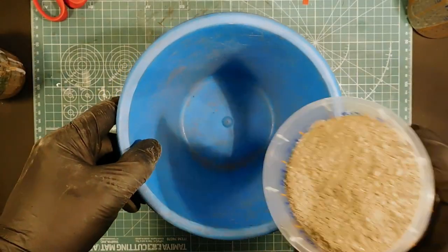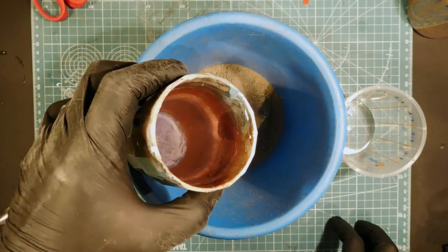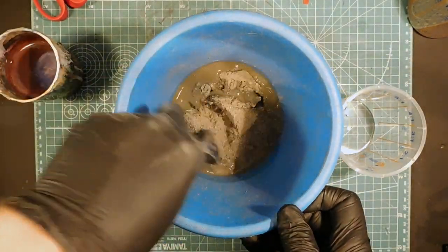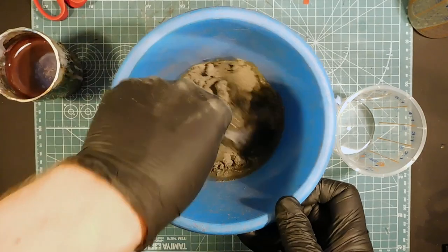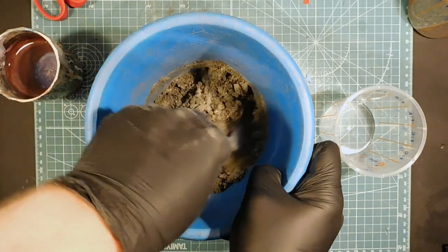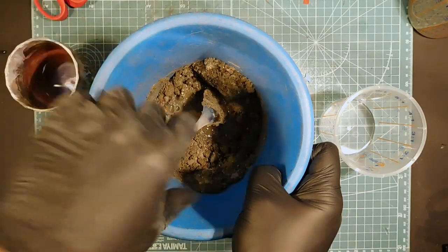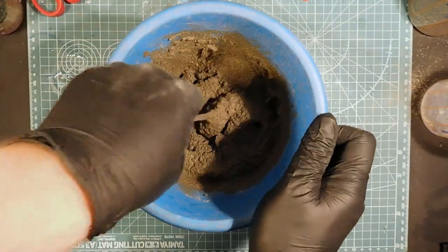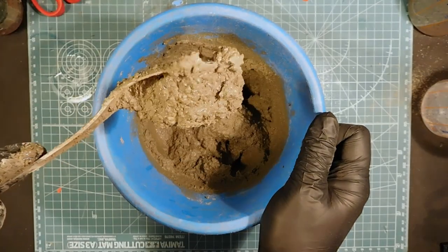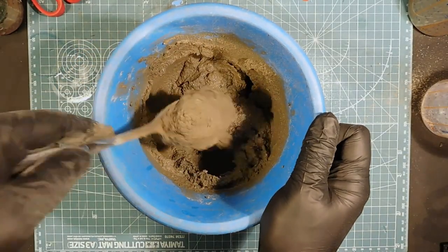Next, I mixed the concrete. I'm using, I guess it was Weber's, pre-mixed, ready to use, just add water type of concrete. So I just followed these instructions and used the water, so the sand and the other stuff was already mixed there, so that was pretty easy. The texture is right when it feels like a porridge or like a sticky chocolate pudding.